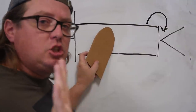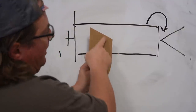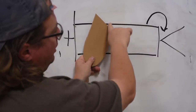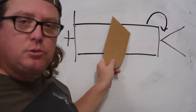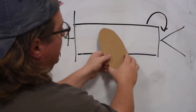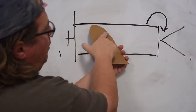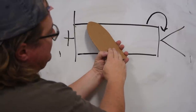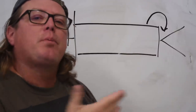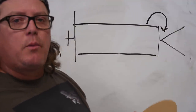Now, second go, I just did a skewing cut. And if you have a skewing tool, same exact thing. You engage the blade on the bottom third, which a lot of times we will kind of move it towards. And look at that angle, roughly 45 degrees as we're shaving across. So, same exact thing. If I were to cant, take my gouge, lay it on its side, and engage the blade way below center, I can still have the wood coming off at 45 degrees. So it's all about how we're presenting the tool to the edge, or the direction that it engages, that is what we're talking about.